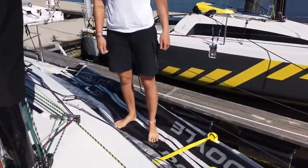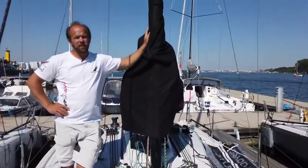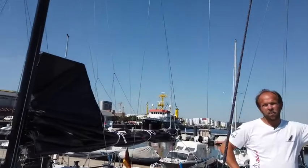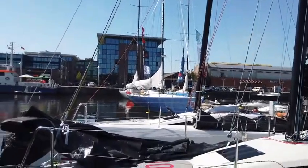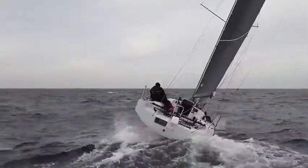There are several sails available. A mainsail with a large square head and several forestays, 2 asymmetric spinnakers, 1 flying head sail, as it is a Code 0, one non-overlapping Genoa, and a staysail, which is usable as a strong weather jib.